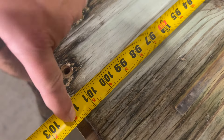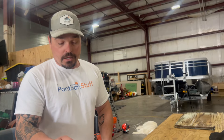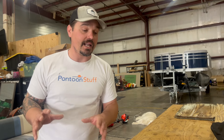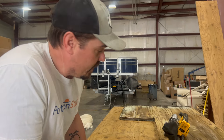On an eight-and-a-half foot boat, it's really important to measure your plywood before taking it off, because in this case even though this boat is on paper eight-and-a-half — 102 inches is eight-and-a-half — it's more like 101 and a half, maybe 101 and nine-sixteenths. It's just a little odd length; they likely did that so it would be legally trailerable at eight-and-a-half feet. That means I'm going to have to knock off that half inch on every single board I'm laying. If I don't do that, my deck trim is not going to line back up. Measure your boards before you start installing them — big help, hopefully saves you a headache.